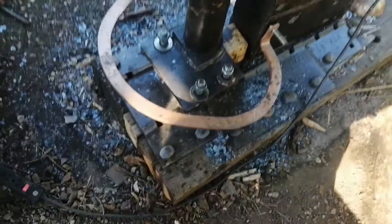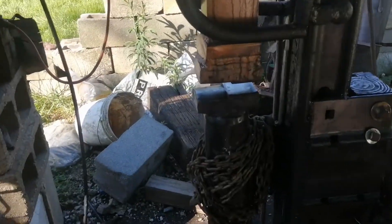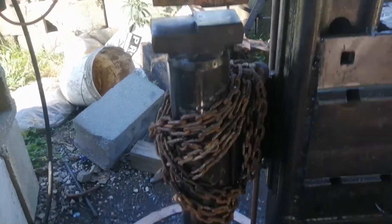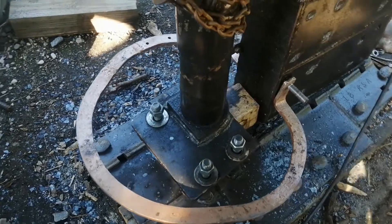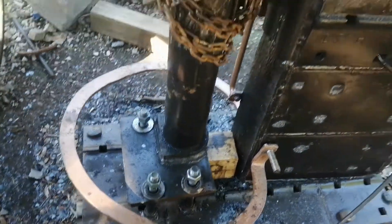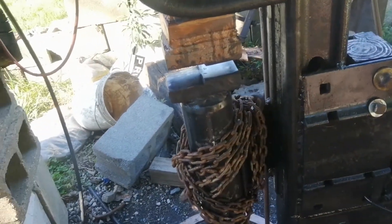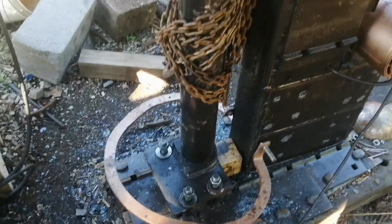Having the anvil not directly attached to the base lets me adjust the height of the anvil. A big limitation of mechanical hammers is that you have an optimal size of stock to work with, and if you go above or below that you start losing power. Being able to move the anvil around — you can see it's resting on a three-and-a-half-inch wood block down there — lets me drop it down a few inches to get in there with tooling, or have it set up optimized for hammering on about one-inch stock. I can hammer on two-inch but get a little less power, and taper down pretty much to zero.